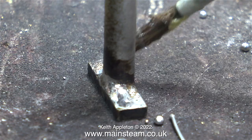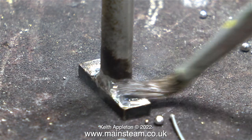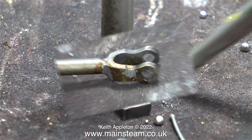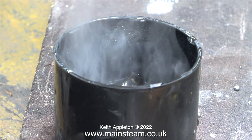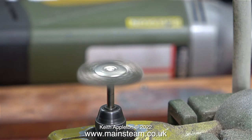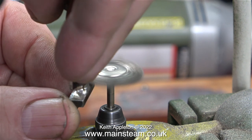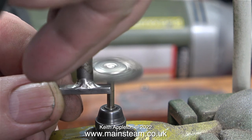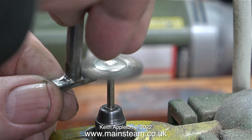It's very important to make sure you synchronise this job — you must not point the blow torch at the work when the brush is there. After the soft soldering job there's a bit of staining, but this is easily removed. I let the part cool for a while and then dropped it in a pot of water so I could handle it. To clean up the solder a wire brush is a good idea, but I really hate this type of wire brush. You must wear eye protection when you use these.